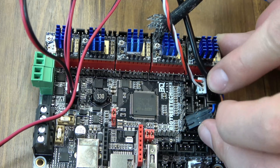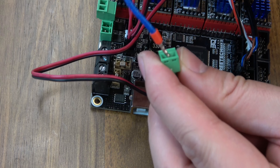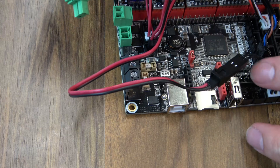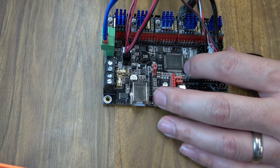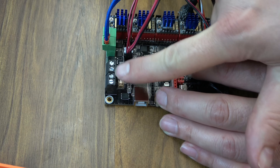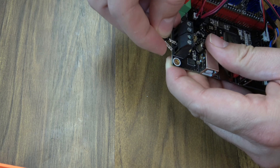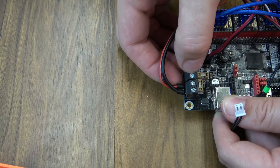On this board it's kind of nice because you can pull these connectors off and then just screw down our hot end heater. This first one is heater 0, and this one is heater 1. Be careful because these are the heated bed pins to power it up, and the polarity is flip-flopped between heated bed and power-in pins. For the heated bed, the outside one is ground and the inside is voltage. Make sure you get them snugged down as good as you can.